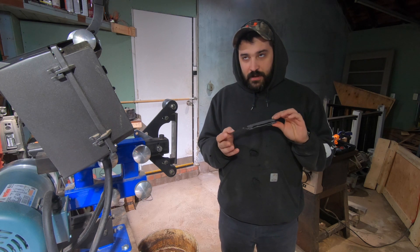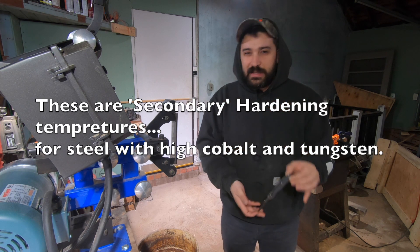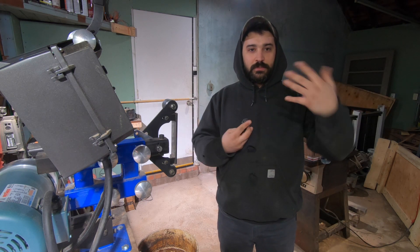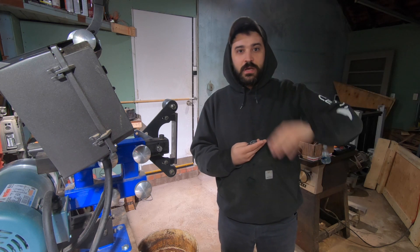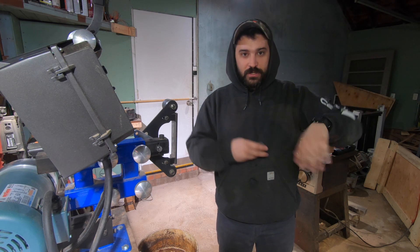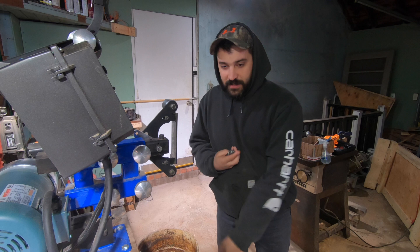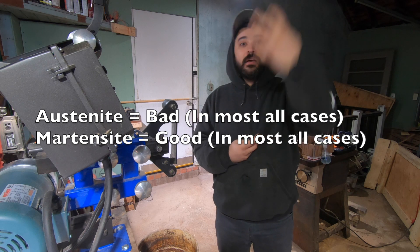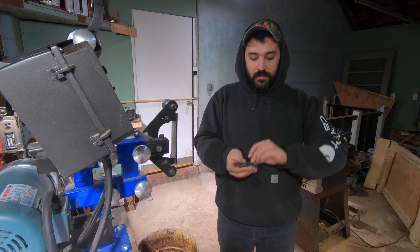Dissolution inside the steel — it goes away. It does come back a little bit when you get into tempering temperatures, within close to a thousand degrees. So you austenize the steel; your carbide formers dissolve at different temperatures. If they don't, then they're growing in size, which is a different discussion. And then after we quench, we turn that austenite into martensite. Then we try to take all of that retained austenite and turn it into that harder martensite — we get those tungsten atoms back.